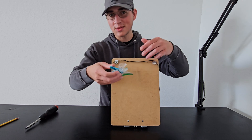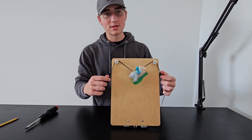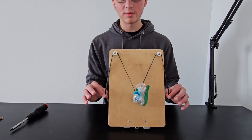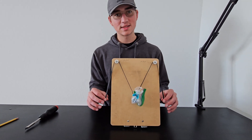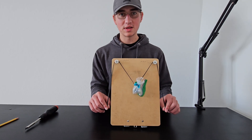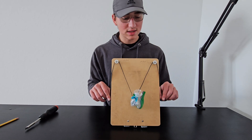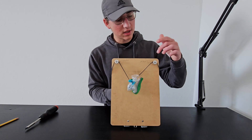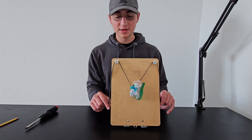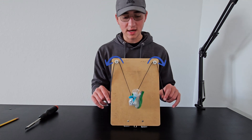In this case it's a clothespin and some hardware. This gondola is theoretically going to be able to move all over this board. We do that by first attaching weights to where my fingers are pinching the timing belt, which will avoid any skipping or missing of steps, which causes a ton of inaccuracy in the drawing. And then all we have to do is move the motors in a way that we change the length of our timing belt on the inside — this little distance from the motor to the gondola. If I want to move the gondola down, all I have to do is rotate both of our motors inward.